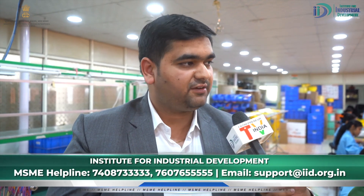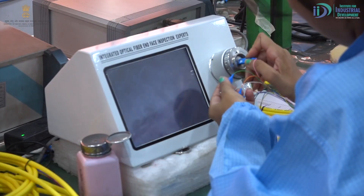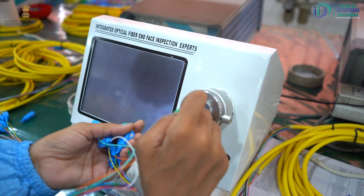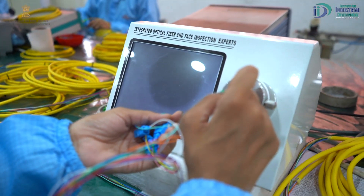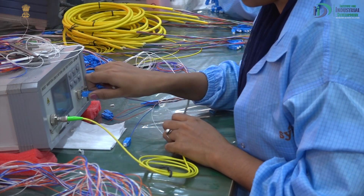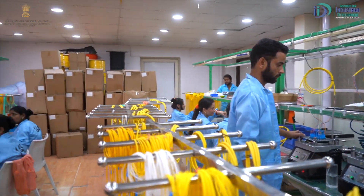The end face of the connector is cleaned through four polishing steps. After the polishing machine, the process moves to the testing phase. In the testing phase, a microscope is used to check whether the ferrule is cleaned properly or not. After that, there is a loss check — insertion loss and return loss — which show the technical quality of the cable.